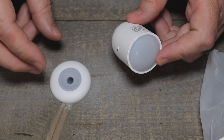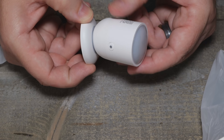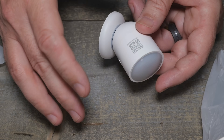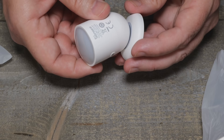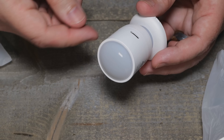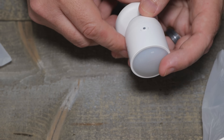Looks like the sensor face — it just magnetizes. That is actually kind of a cool mount. But I do wish it were a screw-type mount, because with MMWave sensors the direction really matters. You want to make sure it's not looking at something that's moving. If someone bumps it while dusting the wall, the sensor direction shifts and then your sensor doesn't work. I'd like to have seen a mount that actually locks down — more like a turret with a set screw, like a camera mount. That'd be cool.